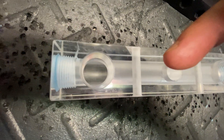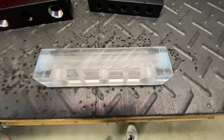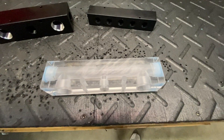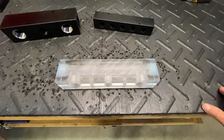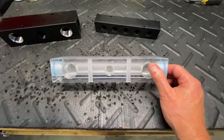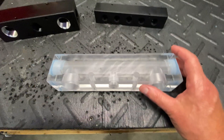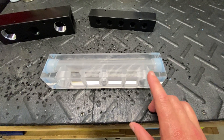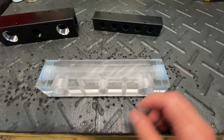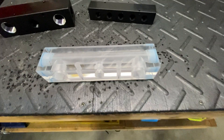You can see that it cracked — if you look down through the bottom you can see the crack right there on that last set of threads on that block. Now I do not over-tighten my stuff when I build proportioners — they're always hand tight. I use tools only to line up my hexes. I also noticed that Cigar City Soft Wash down in Florida, who also uses precision flow metering valves, has stopped using the acrylic blocks from the makers of the precision flow valves because of the cracking issue and the company's failure to stand behind it.